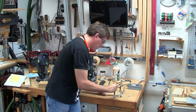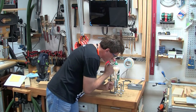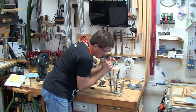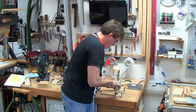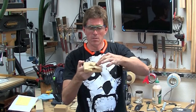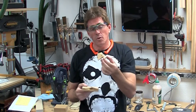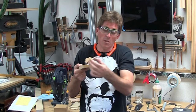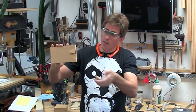So this is the unreinforced joint. Now let's take a look at the screw that has the domino — hopefully I need a little more effort on this one. All right, let's go for it. While it didn't exactly hold it in, you can see you had to take off a pretty massive amount of that stock that came along with the domino. You basically had to rip the whole domino straight out. If you were trying to make sure it gives the most resistance, I'd say mortise it the whole distance so you can tuck that domino in flush. I left it out intentionally for the video, but you can see how much this thing had to crumble apart.